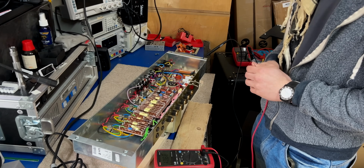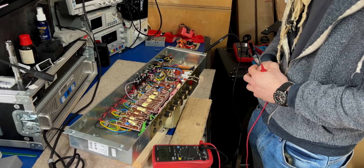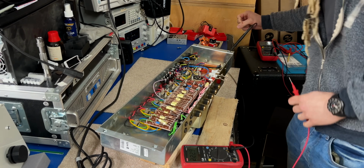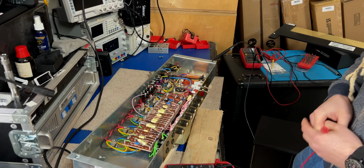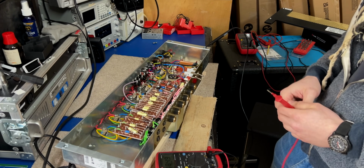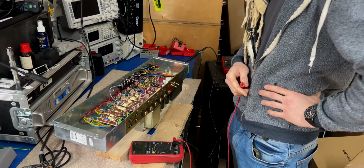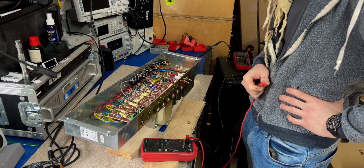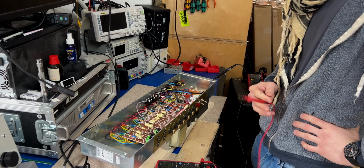Yeah, right. So what we're gonna do is rebias the amp at that voltage, which is gonna change the sound drastically, on the output stage. And then we're gonna be rolling some preamp tubes, and go from there. Take it one step at a time. The idea is also to bring it a bit closer to Eddie's amp. So the fat cap maybe, the different mid spot. We're gonna adjust the negative feedback. Maybe we can change some of the coupling caps too.